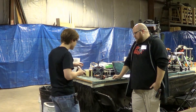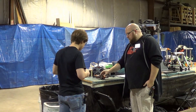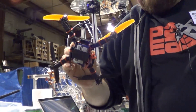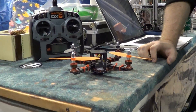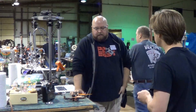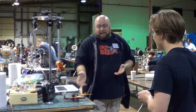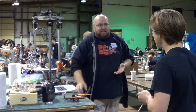So for the electronics, what's involved here? This has what's called a MultiWii-compatible flight controller. I believe the model is a Crius, but there's a whole bunch of them on eBay and various other places. It runs software written in Arduino and has the option to use all kinds of sensors — gyroscopes, accelerometers, airflow sensors, barometric pressure sensors. I can even hook GPS up to it and give it waypoints to fly around the city.